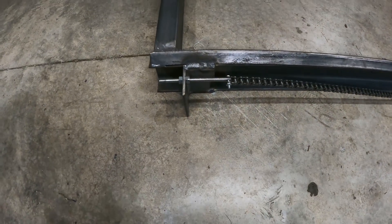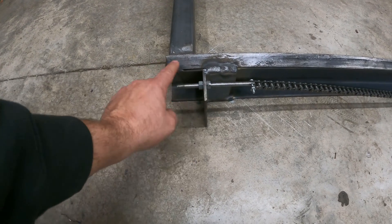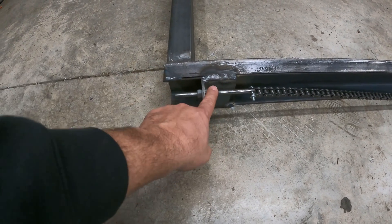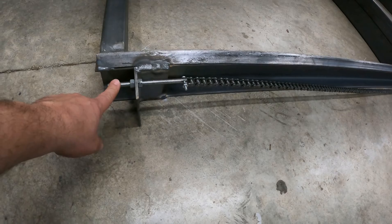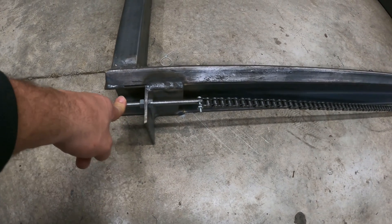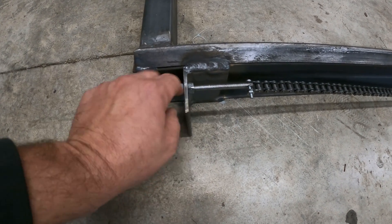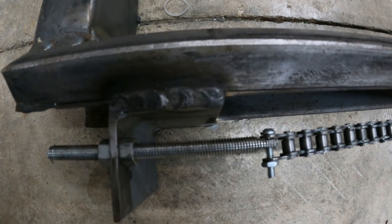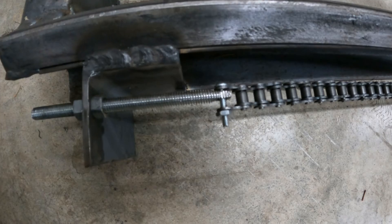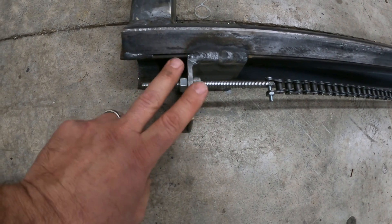Down here at the far end of the bed, I welded a piece of angle iron and then took a three-eighths piece of all-thread and made a tensioning rod for my chain that goes back to the carriage. That way I can take up the slack I want here — whatever I decide to do, I can change that tension. I just put a bolt through the end of it, cut it and made a little notch in it to put the bolt and secure it. Then did something likewise on the other end, but it's just a bolt and a nut. I'll do all my tensioning down here.